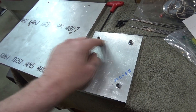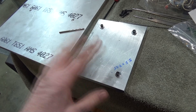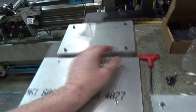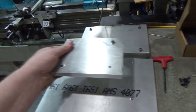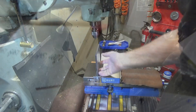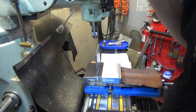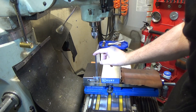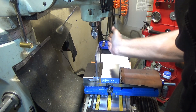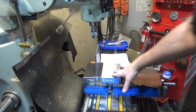Next up on the hit parade we're going for an easy part - we're going to take these two pieces apart and drill and tap the ends. We'll start by drilling and tap later. These mount in between the two side pieces at an angle and they're the trough that feeds the needles in. I've got this thing up on end coming up to the stop so I can just flip it and do the exact same thing. I scribed a center line using a center drill just very gently to check for any twist in the plate and make sure I stayed on the center line, because that could be a big problem.